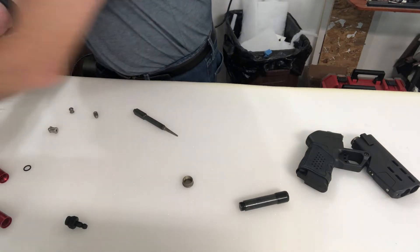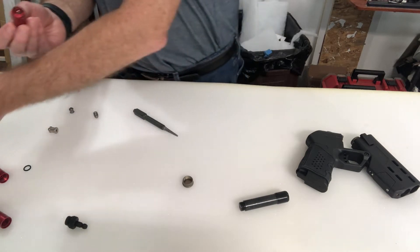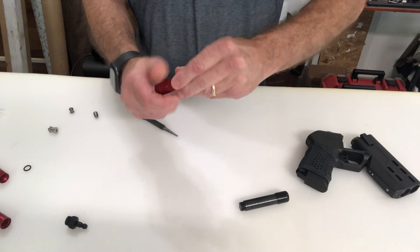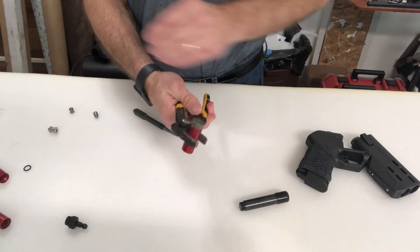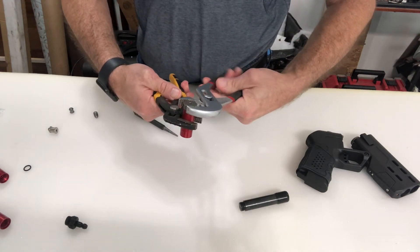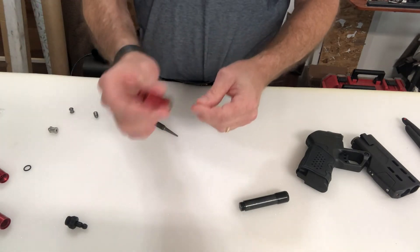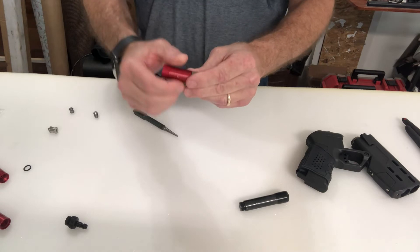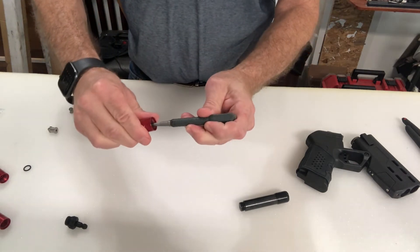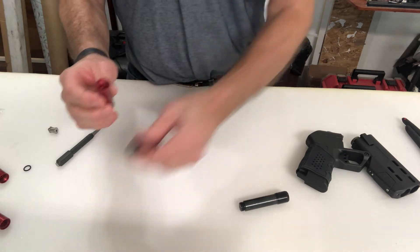What I usually do is put a little bit of silicone — just a small spot — rub it around on my finger, then tighten this up. I use two slip-joint wrenches and just give it a little tweak: hand-tighten it first, then just a little tweak with the wrench. Once it even has a little bit of pressure in it, you are not going to be able to pull that off.